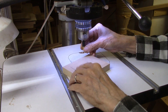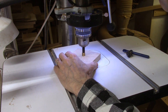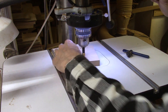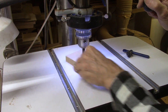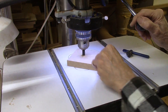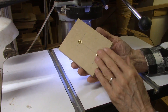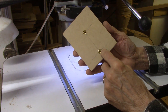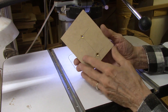I repeat that for the second insert. I took it slightly below the surface — it must not stick above the surface of the board, so it has to sit below. I'll lightly sand the surface in case there's a slight bump where the threads may have expanded the wood. That's all ready to go on the AccuSlice carriage.